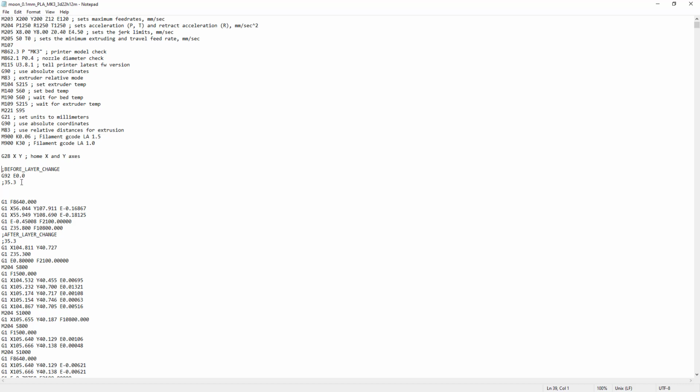And this is where it kind of gets iffy. When you're doing this particular stunt, you want to keep an eye on it for at least the first layer. If you hear it hitting at all, then you might want to adjust that for the next layer up. Just know that. This is to minimize any seam. When you're happy with it, one big tip I can give is: when you're about to start, have the printer heated up and clean the nozzle, because you're not going to prime the nozzle since you're starting in midair, and then just start immediately. That way you run into the least amount of problems as possible.